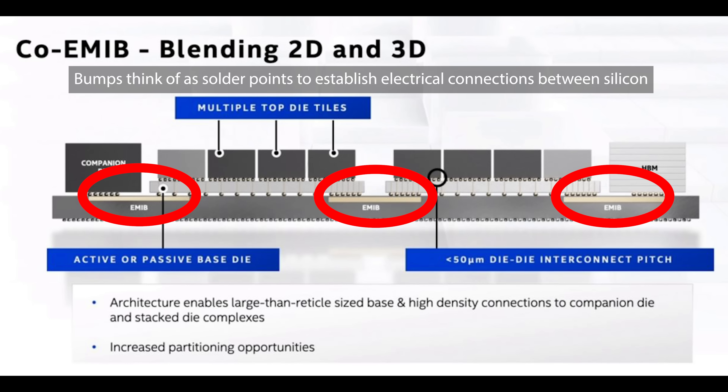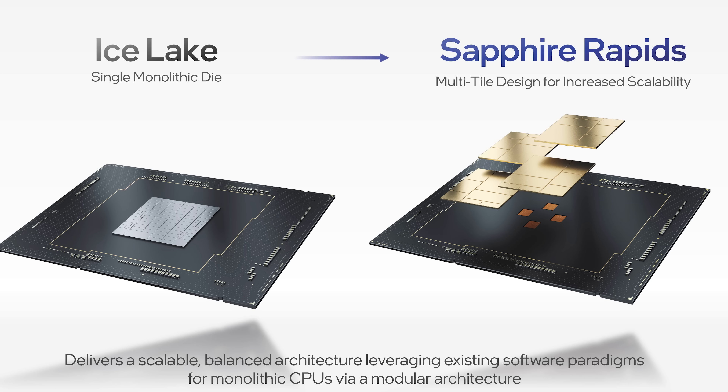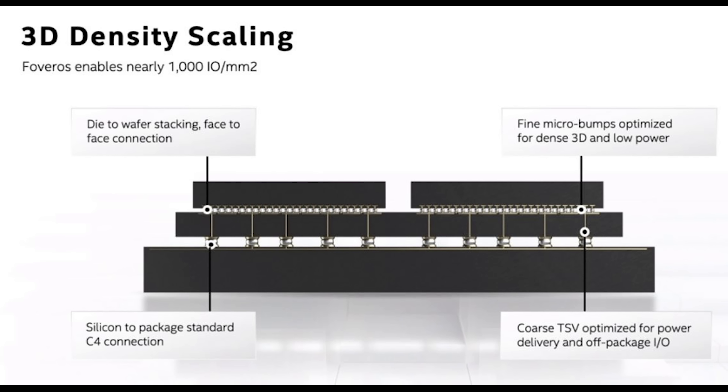With EMIB you have very, very small bumps — think of them like wire terminals — which allows very high density interconnects, because you can have more wires the smaller they are. If you have more wires at low enough power, you can get enough bandwidth between the different chips to make multi-chip possible. Intel has been doing EMIB for years on their Agilex FPGAs, and they're now bringing it into both this product and the upcoming Sapphire Rapids. Foveros is a little different: the basic idea is that you can stack dies on top of each other — instead of just a single plane of dies connected via EMIB, you can have a tower of dies stacked on top of each other, enabling 3D packaging, a super new area we'll start seeing in server chips in the next year or so.